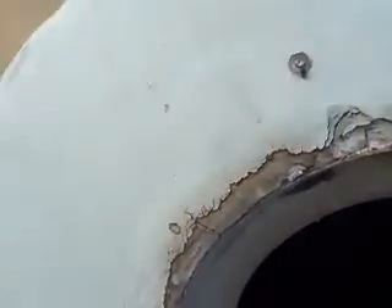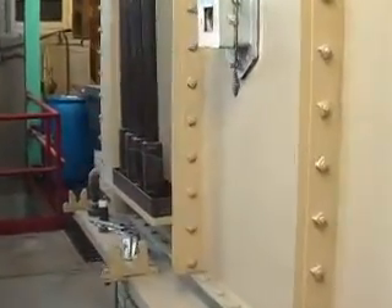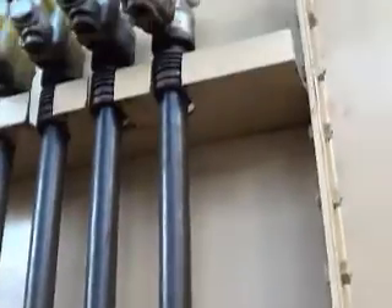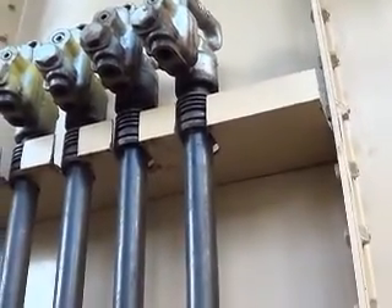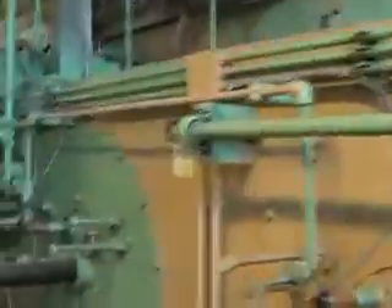This boiler didn't always have an economizer on it. Everything's about temperature and pressure and everything's moving all the time. These here are your oil burners — you slide these in place and you can run number two diesel oil, spray it in there, atomize it with air, and you can get a flame much hotter and much brighter than natural gas, but much more expensive as well.